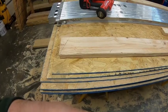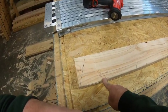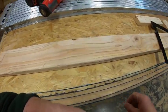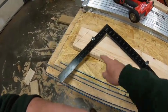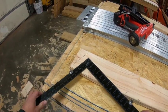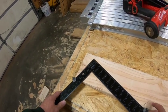We're laying out our rafter now and we've crowned it, this edge being the top. I'm doing a 5/12 pitch. There are multiple ways to do this — I'm going to use my framing square with these stair buttons, or whatever you want to call them, and they're set to 5 and 12, so that when it's on here it gives you the correct pitch angle.